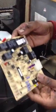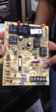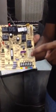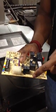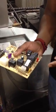First thing I'm going to do is identify some of my terminals on my board. Of course this is for your thermostat. This is your 24-volt pin connection — all the 24 volts taking place in the heat cycle and the 24-volt control for your air conditioner is going to go through this pin connection right here. This is your neutral bar — that's where all the neutrals of the system will be located. Any neutral needs to go back to this spot right here.